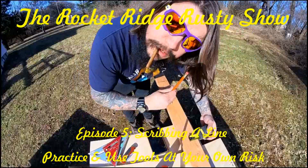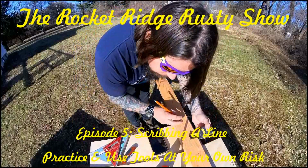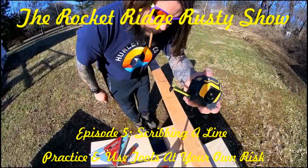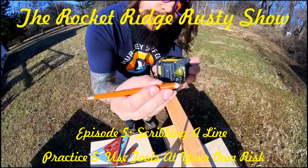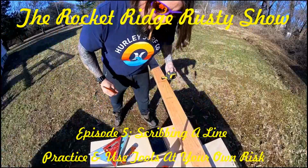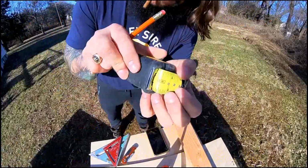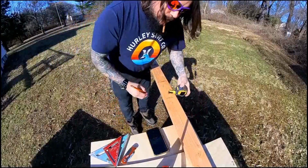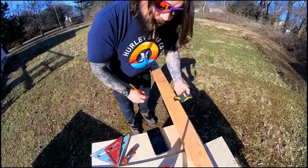Now what we're going to do is hold it on that line and make sure that it's exact. And then this is that method I was showing you in the last video, where you take the tape and you scribe it. So you got the tape here. Check this out. This is the tape, and this is the pencil. You hold it right on the edge of the tape, you put it there, and you're gonna slide it. See how it slides on this? Look at that smooth piece of metal, how many times I've slid it. Very smooth, right? And then you're gonna slide it while maintaining that it's locked with the pencil there.